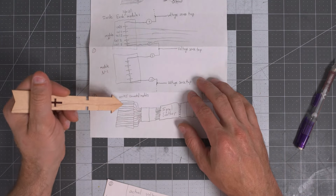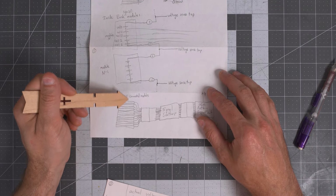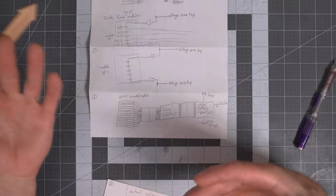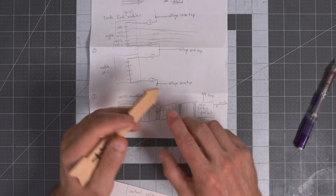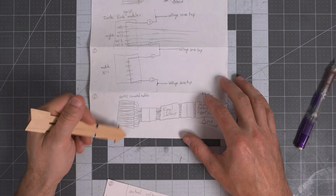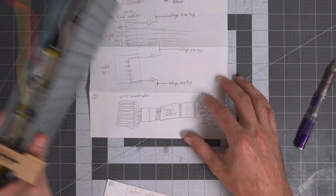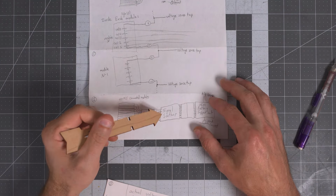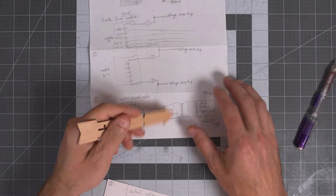Now, fundamentally, if that happens, that means something is wrong with your pack, right? Under normal conditions, no matter what the pack voltage is, all of the cells should be balanced, whether it's 3.5, 3.4, 3.2, 3.1 for lithium iron phosphate cells. The signal soother is fundamentally unnecessary just in the abstract. If the pack is in good health, the signal soother is not required. If the pack is in bad health because it's poorly designed, then the signal soother is only a band-aid. I think it should be called a signal faker or a signal averager instead, and we'll look at why that is. But anyway, that's what the signal soother is trying to do.